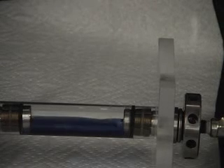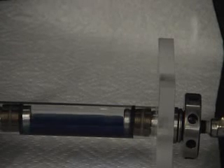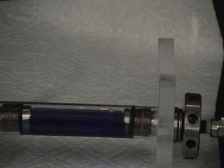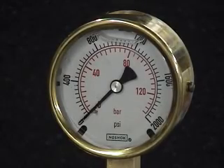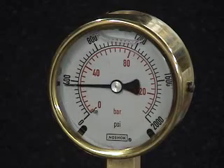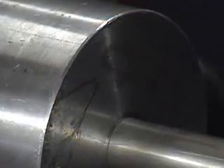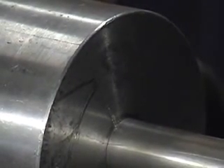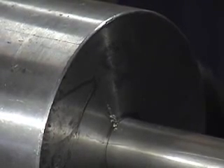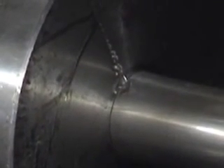Once the full tube testing fixtures are in place, water is injected to fill the tube completely. Once the tube is fully filled and the bleeder valves are closed, the tube is ready to be tested. Testing on a leak-free joint will result in no pressure drop. On this test piece, we have created a leak. As the pressure builds, the tube joint is tested and any leaks on the shell side will become apparent by water seeping past the joint.